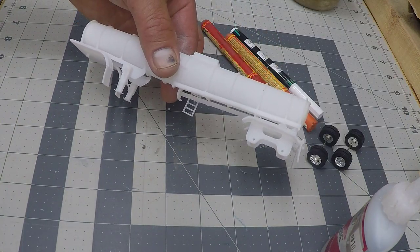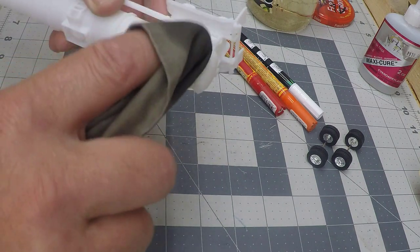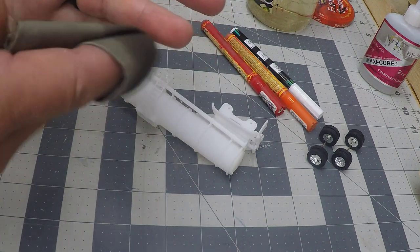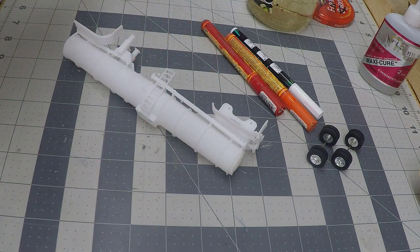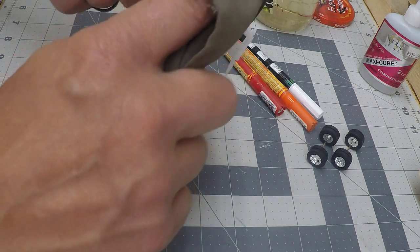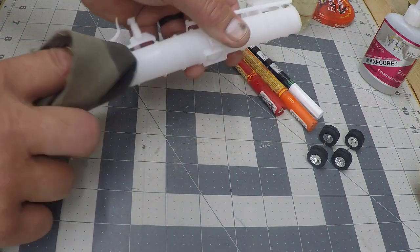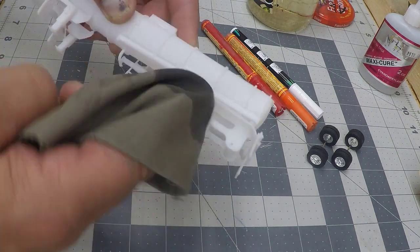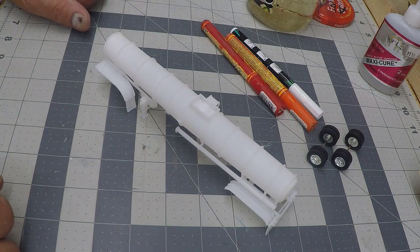At this point, we are ready to clean it for prime and paint. To clean the plastic, I'm using rubbing alcohol on a rag. Before you start, it would be a good idea to use a little rubbing alcohol on your fingers just to remove any oils that might be present or contaminants on your fingers so it doesn't transfer to the plastic as you clean. I'm wiping down the surfaces generously. The alcohol does evaporate so it won't be a problem if you get too much on there. You'll notice I'm spending a lot of time on the large surfaces, not so much on the fine detail. Now we're done. Once the alcohol is all evaporated, you're ready for prime and paint.